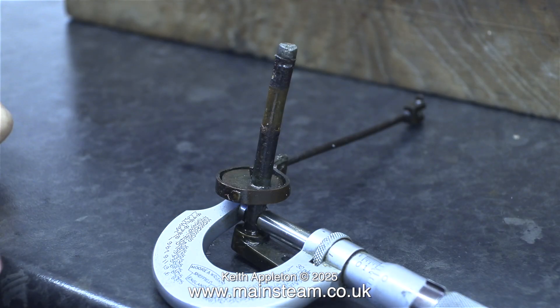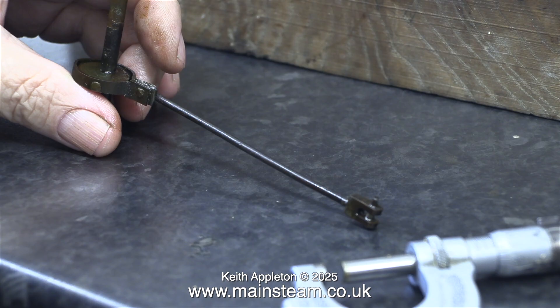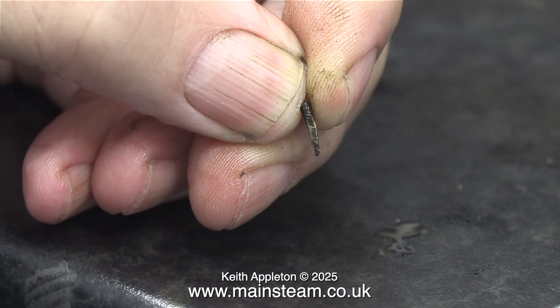Moving on to the eccentric — all of this is a bit grim really. I think I may have figured out how to fix this and I'll show it in a future episode. It's quite a simple fix. I will have to make an extra part for the sheave and use it to fix the sheave to the crankshaft. The eccentric sheave was secured to the crankshaft using a really unorthodox method — a special wedge that was tapped in to tightly hold the sheave against the crankshaft. And guess what? It didn't work.